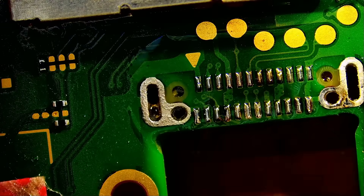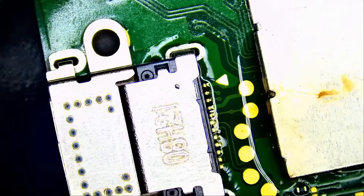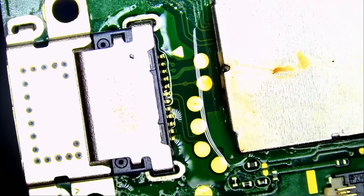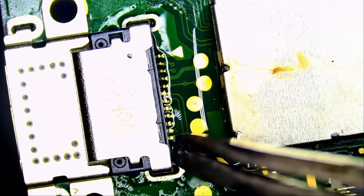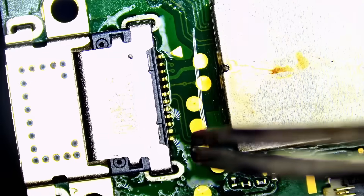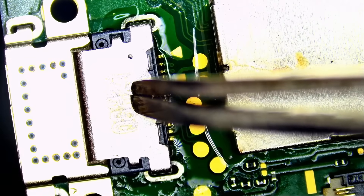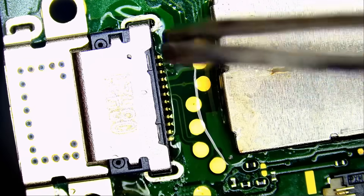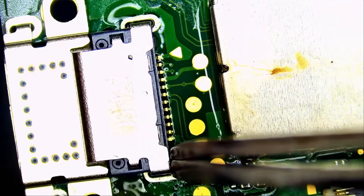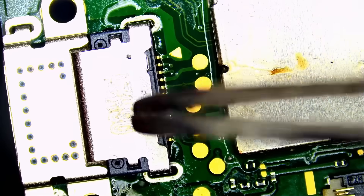The anti-glare light is on — look at that beauty. Now we're going to apply heat from the bottom. You can tell how the hole aligns here. We're going to push down on this column of pins — the ones under the connector we cannot see, but once we see solder melting on the visible column, we know the hidden column has also melted.